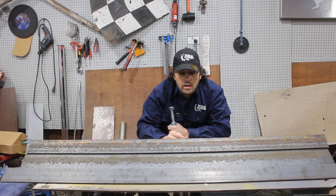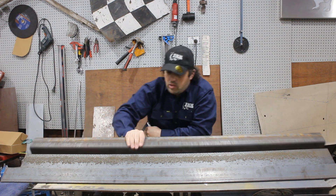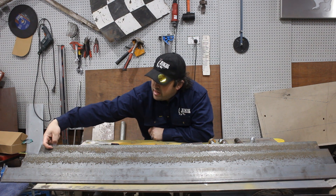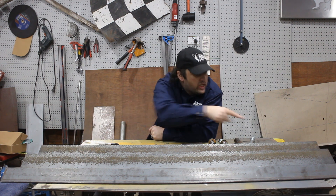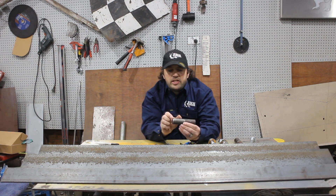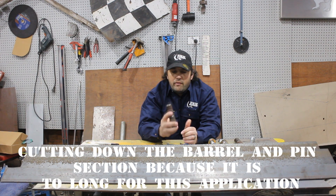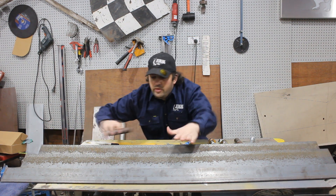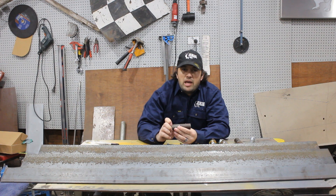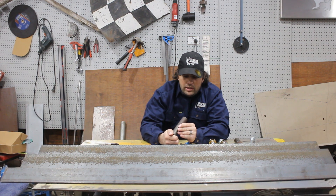We're going to start with the hinges. Now they're 32 millimeters in diameter, so I'm going to cut 100 millimeters and come in 16 mil on each face on each end of the big ones. That will give the spot for this. I'm going to cut this down about 25 or 30 millimeters because I don't need all of this. Then once that's cut down, these two pieces will get clamped together and this will be put into place and then welded. You've got to be careful when you're welding hinges that you're welding the right pieces to the right spot — sometimes they get messed up. So, start with cutting.